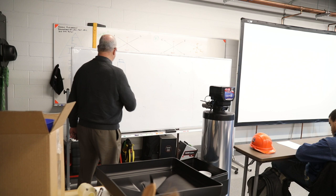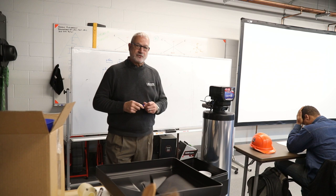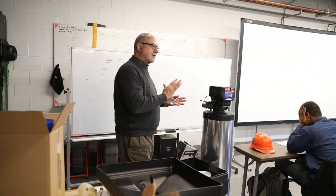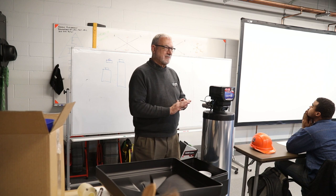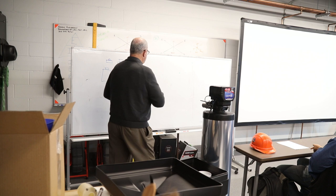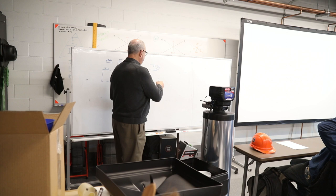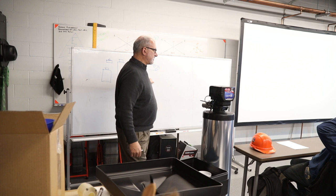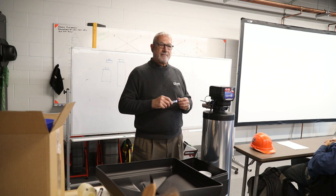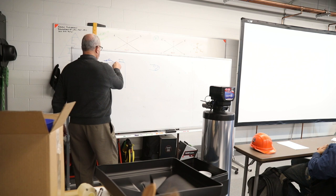We talked about hydrogen peroxide for taking out sulfur, iron, and manganese. We've got a tank that looks just like this, a water meter, and a solution tank with a chemical feed pump. To inject hydrogen peroxide into the water, you can't use a diaphragm pump because the H2O2 will airlock it — we have to use a peristaltic pump. A peristaltic pump uses a tube that goes through three eccentrics — off-center — and a motor turns them and presses on the tube, positively displacing the peroxide. They use peristaltic pumps in the medical infusion field. You eject it into the water based on the flow of the meter.